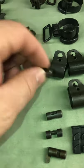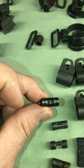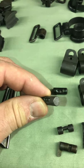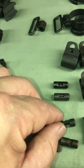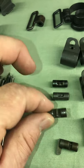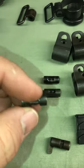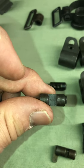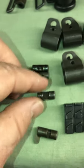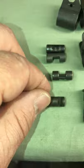Safeties: type 1 has heavy bevels — that's an Inland — and this is how it catches into the plunger system. Type 1 is checkered. Then they removed the checker and made it smooth — that's type 2. Type 3 has that area cut out a little bit more. I've seen transitions between 2 and 3. Plain faces with nothing on them, though this one happens to be marked W-B on the inside for IBM — some were marked there, most on the ends. Type 4 is the flip-style safety.